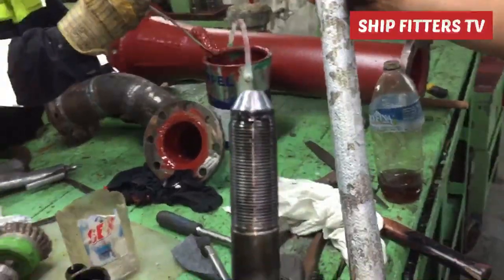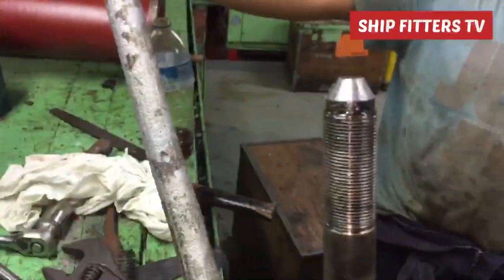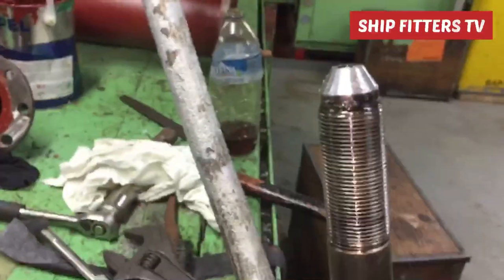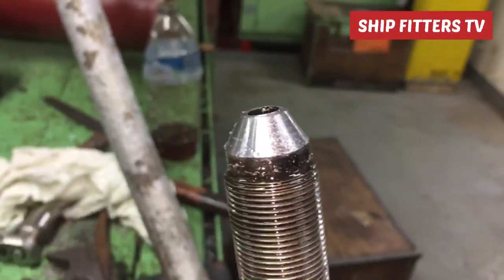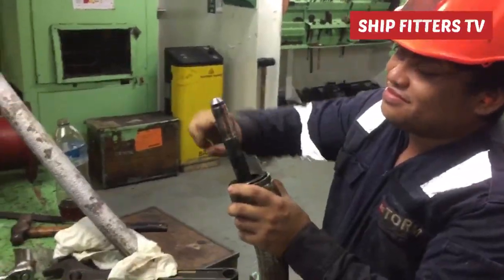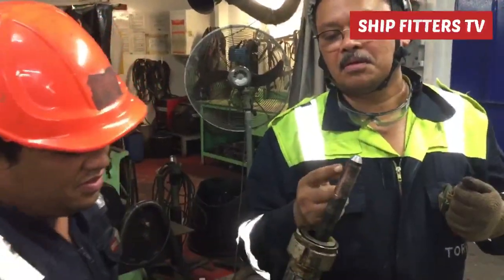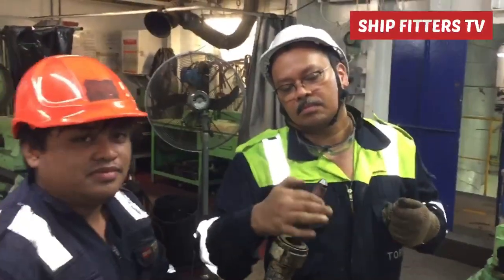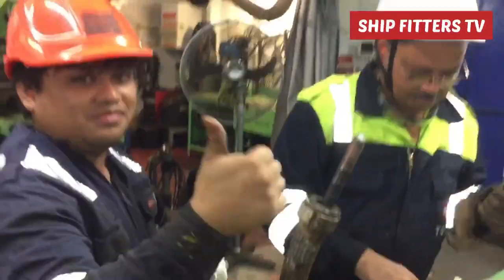Boxing up — as you can see, we now have new seating made by our special tools. That is all the procedure on how to repair these high pressure pipe seatings. After boxing up, you must apply copper slip or anti-seize compound so that in the future it will be very easy to remove, because the copper slip protects the thread and prevents fuel from penetrating.